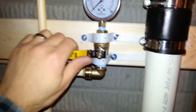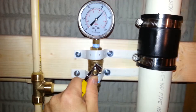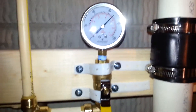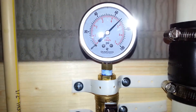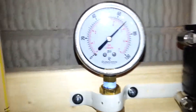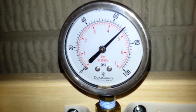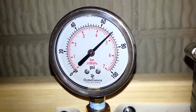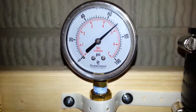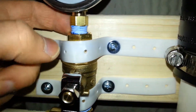Here's the ball valve — here we go. Perfect, look at that, no leaks. It's right at 68 pounds. There's a little bit of glare, but there we go — 69 pounds. I'm looking for leaks; don't see any, don't feel any either.